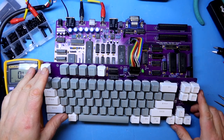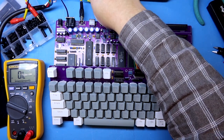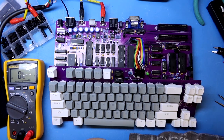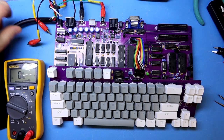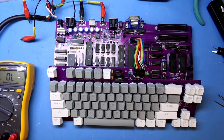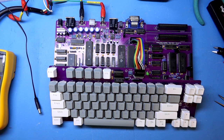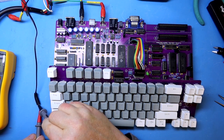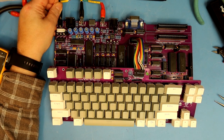I've connected everything up and am ready to test. These headers I'm using aren't very good — after connecting them to a wide connector I'm not sure I have good enough contact. I've connected the video signal and an audio jack, going to my LG 22-inch LCD TV acting as a monitor. The connection goes into the SCART connector — video in and audio in. I measure the voltage: 5.09V at the connector, so that's 5 volts. I'll turn on the TV, dim the lights, and try to see what we've got.